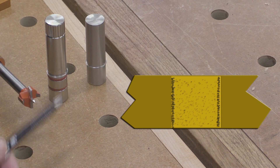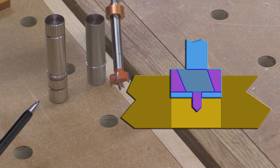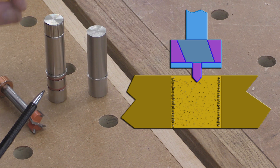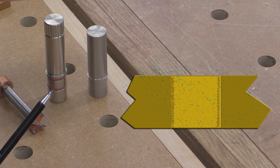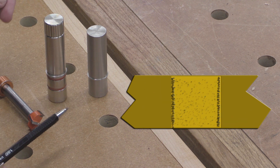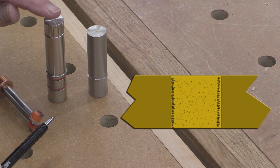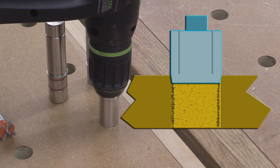The fibres can be there from the very beginning — if one drills a hole too rapidly with the 20mm cutter, some fibres can be left behind in the process. It also happens in climates where there are large changes in humidity, or with certain materials used for your bench top. Some plywood can be a bit awkward, and some lower grade MDF can be awkward as well. But by using the reamer, we can get rid of those fibres.